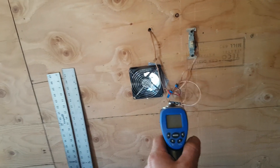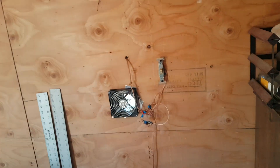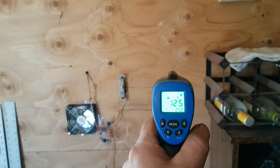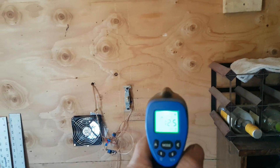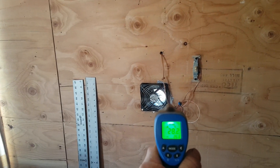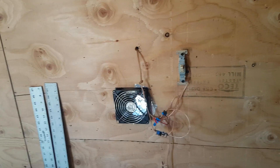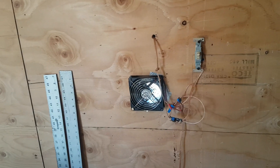I'll shoot the IR gun at it and see what we've got for internal temperatures. The pellet stove is not running. The temperature on the wall is 12.5 degrees, so room temperature is around 17 — we're just under room temperature by about four degrees. I can't get a reading off the panels directly from the fan blowing, but the reading I'm getting is 28.4 degrees. Inside these is an internal snap switch and they don't turn on until they hit 40 degrees Celsius, which is 23 degrees above room temperature.